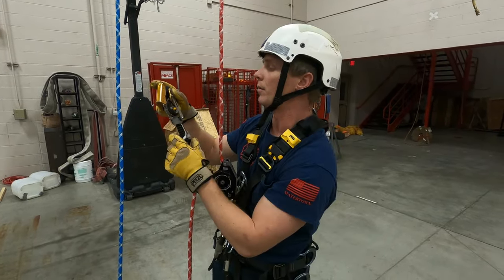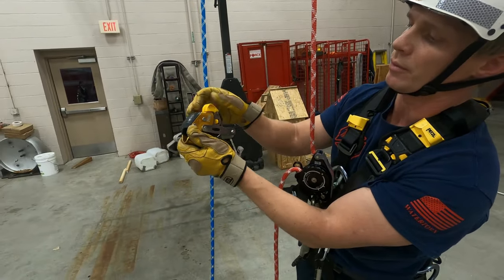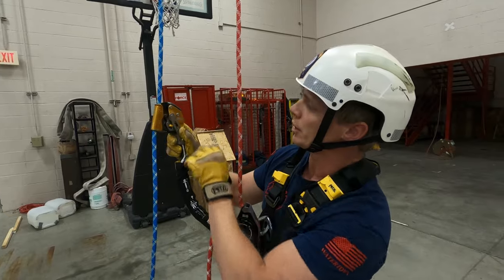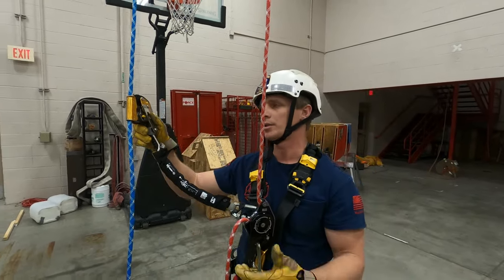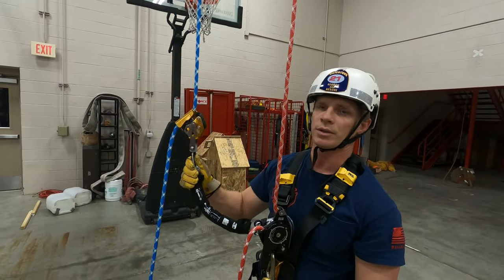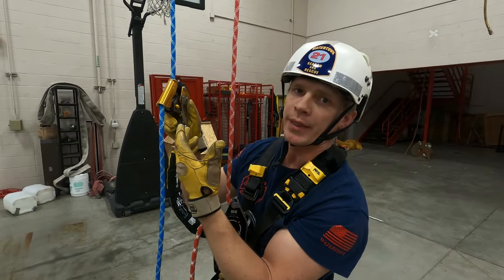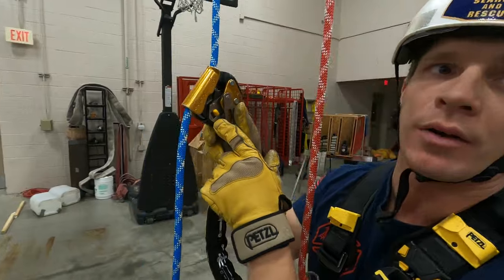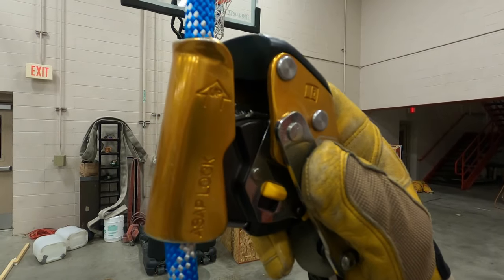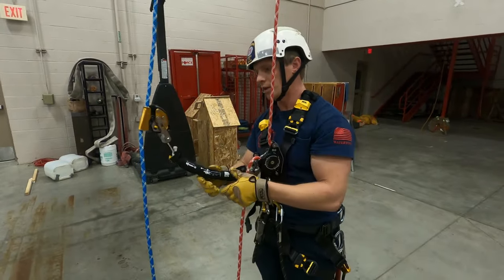When normally stored, it's stored closed. You pull out the yellow handles to open it up so you can insert the rope, then shut it. The first thing we do is a function test — raise it up, then give it a quick jerk down. See how fast that went? Barely used any rope — that's how fast it would have caught you. Before you can do anything else after it locks, you need to unlock it. The lock button does not unlock it in this situation. You need to raise it up slightly and rock it until you hear the pin shift back. Then it can move again.